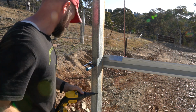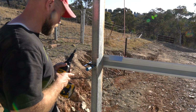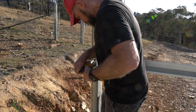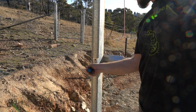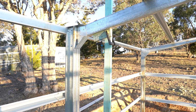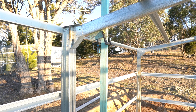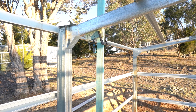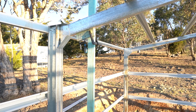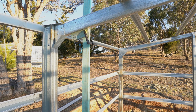For this shed, there's a double truss and column set up in the middle, like a mirror image. My strategy involved lowering one truss first, then adding the second one later. This was far easier than trying to lower a heavy double truss onto haunch brackets that face opposite ways. I used timber to hold everything in place so I could safely remove the bolts from the first truss, add the second truss, then bolt through both together before removing the timber bracing.